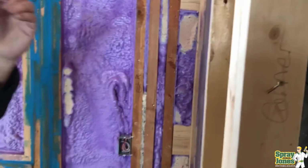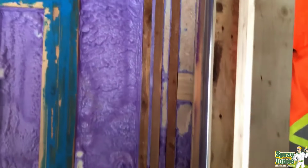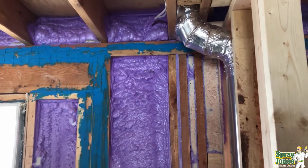And we shave everything off, it sticks out, and then we do the caulking air seal package. Now, why are we doing the caulking on the studs? Because we need wood to wood joints to be air sealed. We don't want air going through it, we don't want water going through it. Is there an additional vapor barrier? No, we are not putting plastic with plastic.